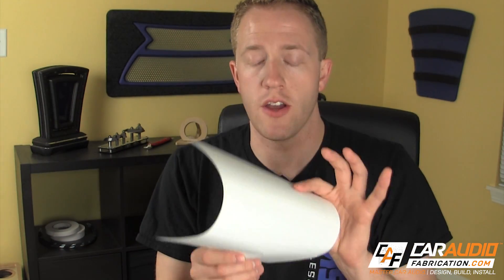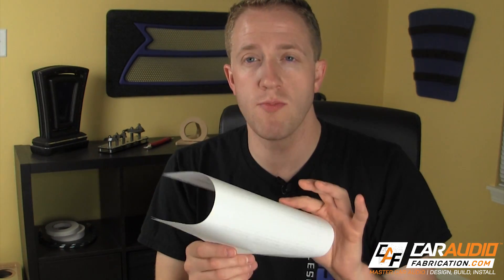Here's why I say this is a minimum: if your part is really flat, like a sheet of paper, it's going to take many, many layers to make it strong enough that it won't flex. If your part is naturally curved, though, it doesn't take as many layers to make it as strong — the curve will actually add much more strength into the shape. Most every mold is a little bit different with a combination of flat areas and curvy areas, so that's why you simply have to build it.